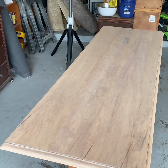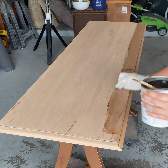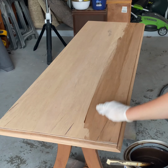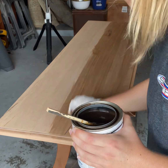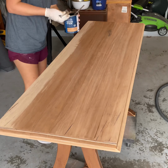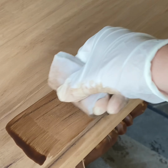before using it. I used this water-based stain in the color Early American to add a slightly darker shade to the tabletop. Since this wood was slightly weathered from all the wear and tear, I thought this shade would look nice and rustic. This stain pad was perfect because it's absorbent like foam, but it's soft like a microfiber cloth.